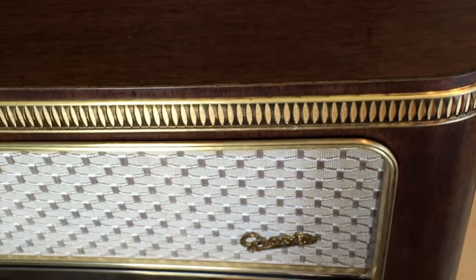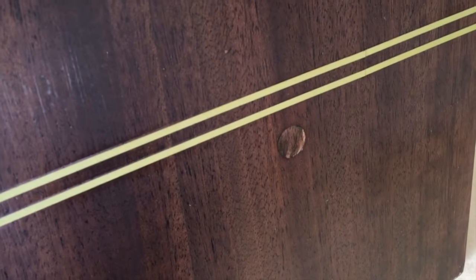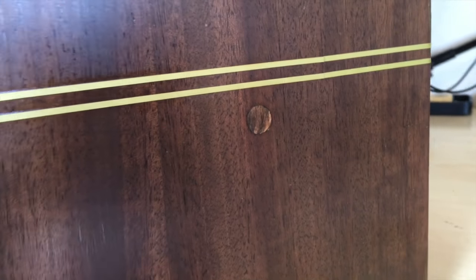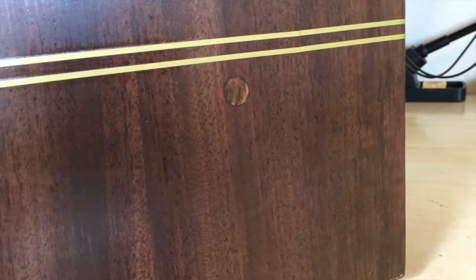One of the tricks I've learnt is to put some water on it — just brush it off with a moist cloth. And if it shows on the surface through the moisture, it means it'll show when you do the varnishing, so you need to get rid of that. The hole we had on the side is still visible — it's filled in with wood filler and then a small bit of veneer was put in, though it's not the exact same veneer. This is as good as this one's going to get, but I've also learned how to do it better for next time.